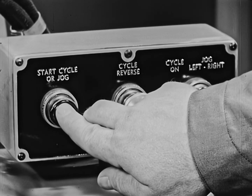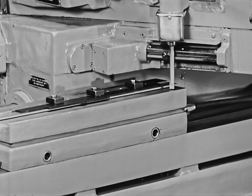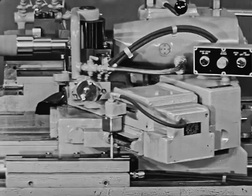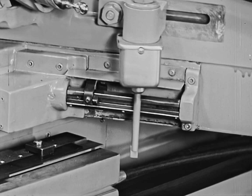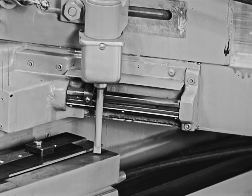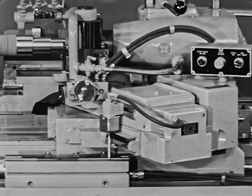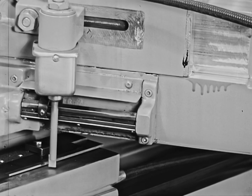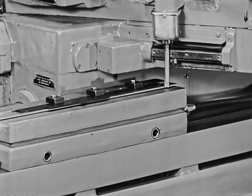Now let's see what these features would mean if this were an actual four-cut cycle production job. There is heavy stock removal, so indexing adjustable stops prevent the tracer's stylus contacting the template on the first two roughing cuts. On the third roughing cut, the air gauge tracer's stylus contacts the roughing template, which is mounted under the finishing template.